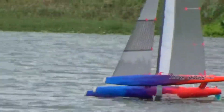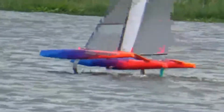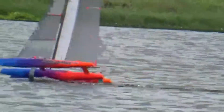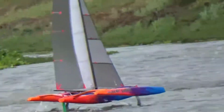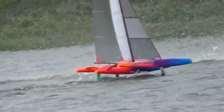Next, the U-foils without the centreboard. The boat is always more lively without the centreboard, but it has to be said that the centreboard is probably too large for this type of combination, and was not designed to be used with foils anyway, but rather for use in light winds only when foils provided no benefit. Maybe a centreboard of approximately 50% of the current area would be worth experimenting. That's one more to add to the list.